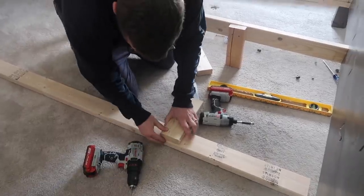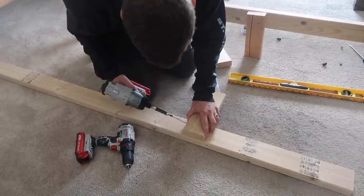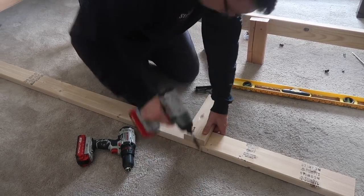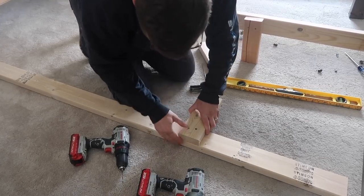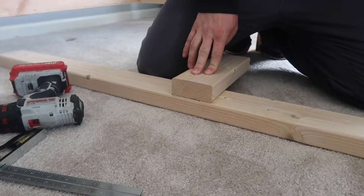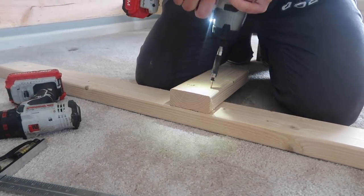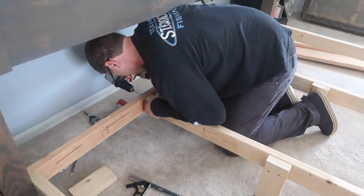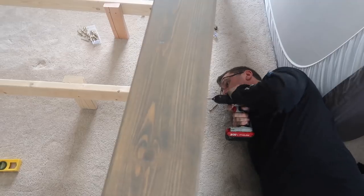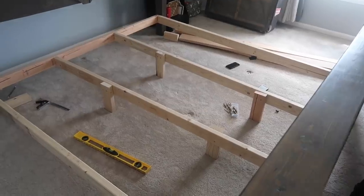After the outside frame was completed we needed some additional supports in the center to hold up the bed. Alex took four pieces of 2x4 cut to 7 inches and used screws to hook them to longer 2x4s — those longer ones are the same length as the outside pieces, 83.5 inches. Those little 7-inch legs make it much easier to sit up and not have all the weight on a suspended piece of wood. They help disperse the weight across the bed. Then he got everything aligned equidistant across the bed and went in with four-inch screws — going directly through the back of that 2x4 piece for the headboard side and directly through the footboard on the front.